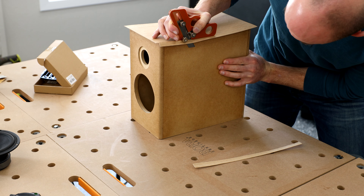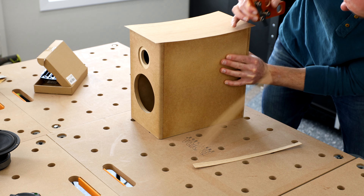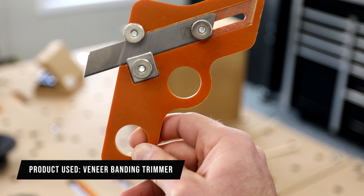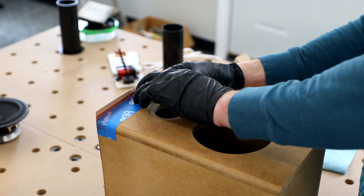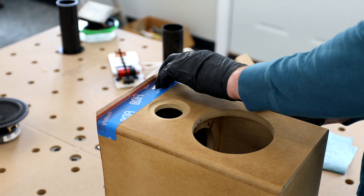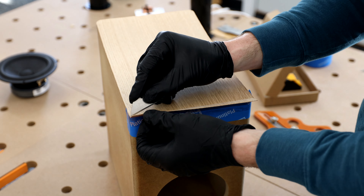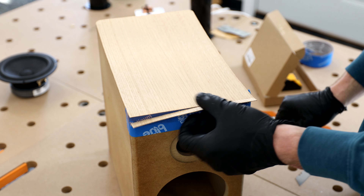There are a lot of options when it comes to trimming veneer. The quickest is a router with a trim bit, but not everyone will have access, so I went with a budget option that works but requires a little more time and effort. I picked up this trim tool on Amazon, which I'll link below. The blade leg can be adjusted and it cuts well with the grain. Against the grain, expect more difficulty, especially with a thicker veneer — here I simply used a razor blade and took my time.